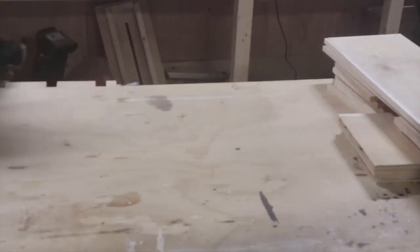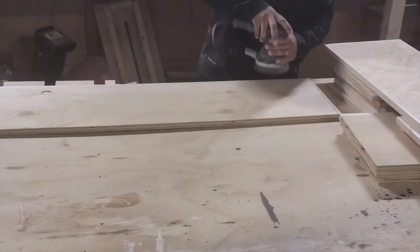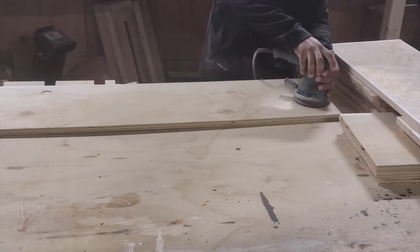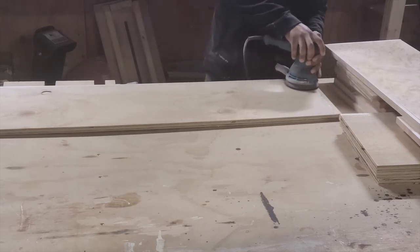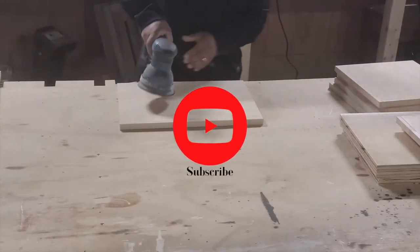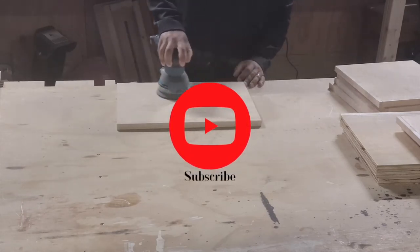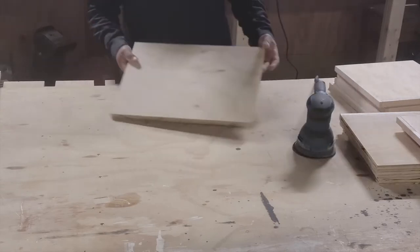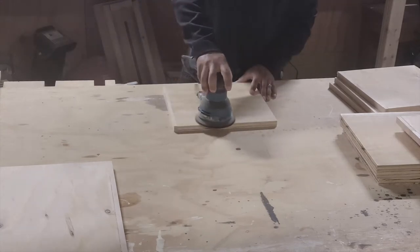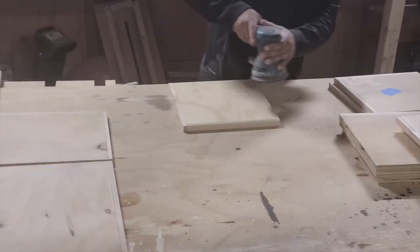So you remember when I said just be generous with the wood glue? Yeah, don't do that. I did that and that was bad. I had a ton of extra glue spewing all over the place. And to compound it, I waited like 2 or 3 days. I didn't get it while it was still wet, and it was dry and extremely hard to get off the pieces, and it created an immense amount of work. A lot of extra sanding, a lot of extra cleaning up.